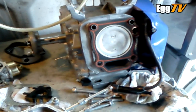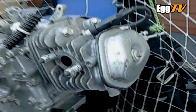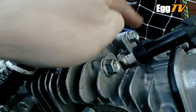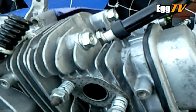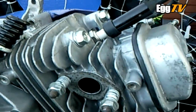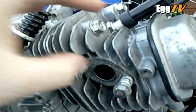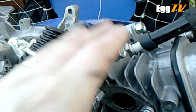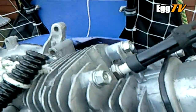Anyway, that's enough ranting - I'll get this head fitted. The head's back on. I oiled the threads - as the karting chaps do; there's a video on the Karttrax channel or something where he recommends oiling the threads to make sure you get a good torque setting. They're all torqued down at 25 foot pounds.